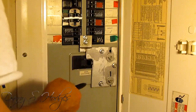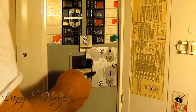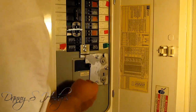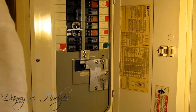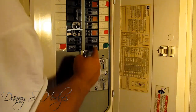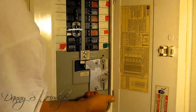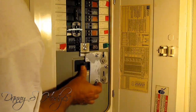Let's get started. Before I cut the power off, I'm going to show you this interlock that I made. I've got a video of how to make this, and I figured out an easy way so you can make a pattern. Here's my power. I've got it cut on, and I want you to notice how slick this interlock is. I'm going to pull my main power off — I've got an inverter over there I'm using for the light. That's got my power locked. I can't cut that on, but I can cut my generator on. This is where my generator is coming in. And only after I move this back can I slide this up and cut my main power back on.